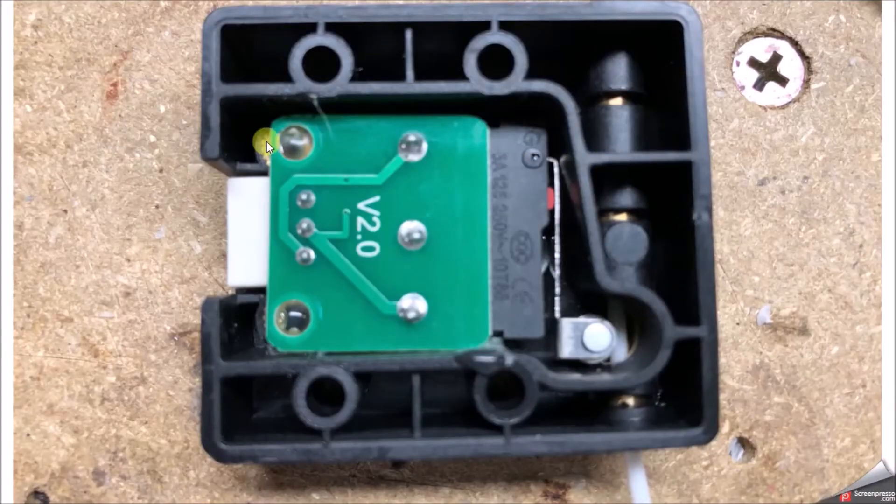What I did is I left the screws off and put a bead of hot glue underneath this switch, and also put a bead of hot glue here, here, and again in here to kind of hold the thing in. When I put the switch back down, I made sure I had filament in there and then I cockeyed the switch as much as I could into this corner and pushed into the lever, so my final position with the glue dried has the hole further over inboard instead of where they currently are — and that's what causes the switch to not be fully depressed.